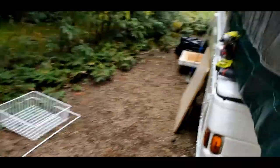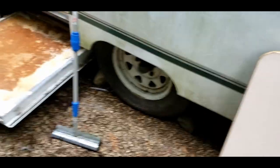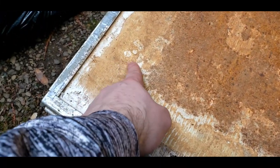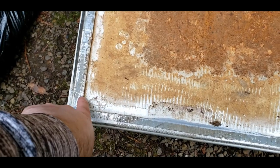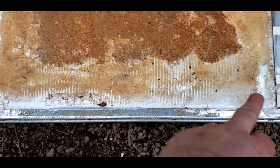Here's the table — we're gonna paint the table black and then just clean it up. Here is the door — you remember it had that yellow linoleum or laminate flooring; pulled it up. So this is rust, and then this right here is the old glue. I'm gonna take an orbital sander, sweep everything out, and sand it down to get all this off. Then I have new laminate flooring that's gonna sit in there. I'm not gonna try to get it to go underneath this groove here — I'm just gonna butt it up and then run clear silicone across the top.